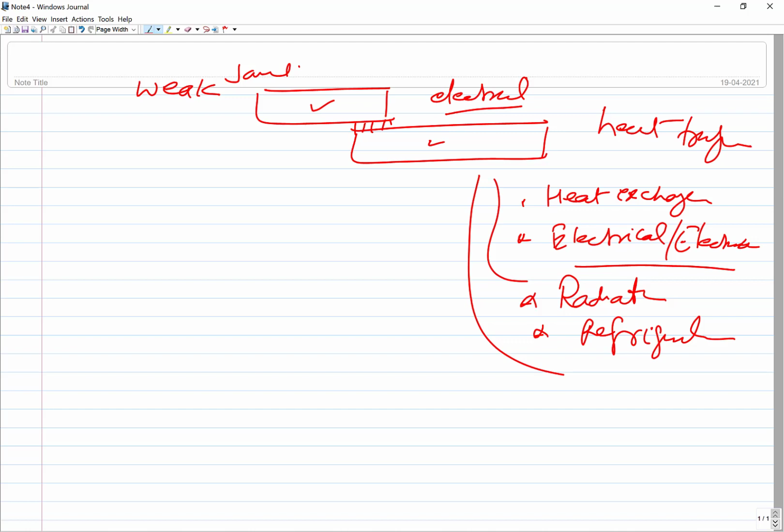Okay, so what are the situations where this kind of joining is needed? Say when two components, A and B, need to be joined, and these cannot be fused together to develop the joint, because whenever they are fused, the joint is extremely weak. So the fusion of A and B and thereafter development of the joint between the two is not workable due to metallurgical incompatibility.